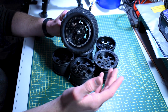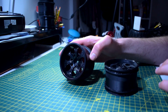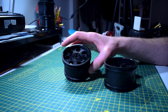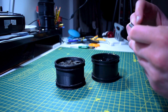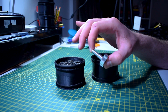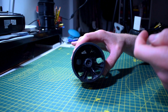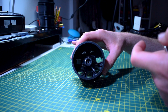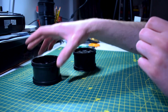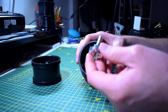Here are two alloys side by side. This one is the original that came with the tires, and this one is my own design from Fusion 360. The motors came with a little attachment that allows you to couple something directly to the motor. The problem with the original is that it has a hex nut inside — which is the standard way to connect a wheel to an RC car axle — but my fitting is very different, so that's not going to work.